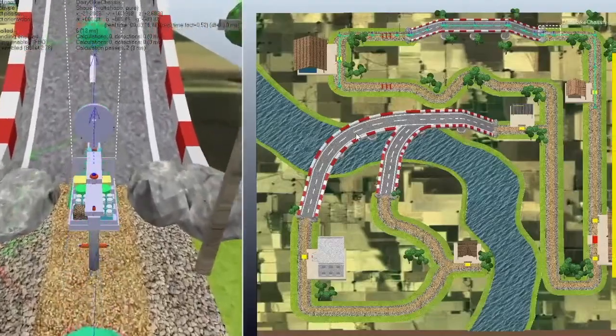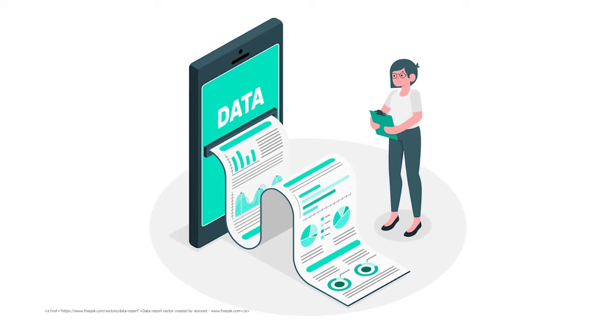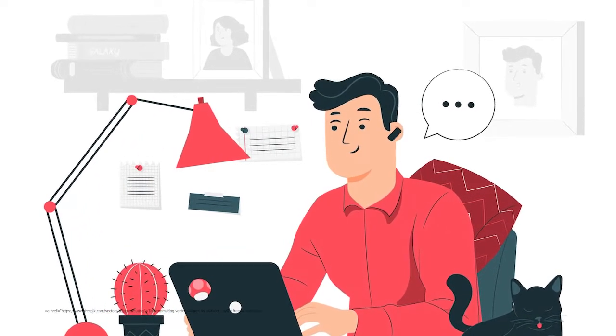For the balancing part of the bike, when we were not very sure whether the correction was taking place accurately, we just printed out the values and saw whether the correction was getting sharper or very slow. So printing out values and checking would be a good option. If you have too many approaches towards solving a particular problem in a code, you can try out everything by commenting out the other parts and running the one that you are about to check now. That's a common thing that we do while debugging.